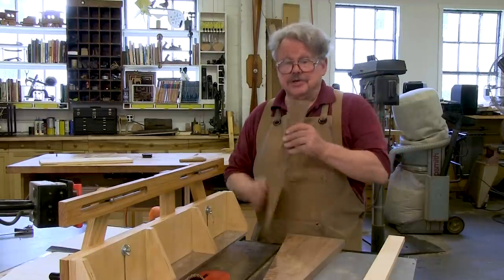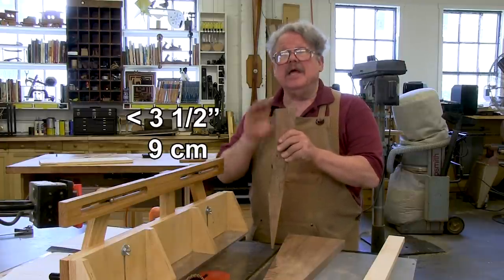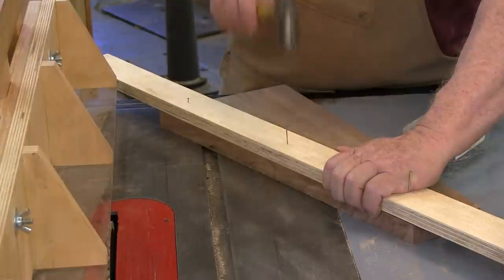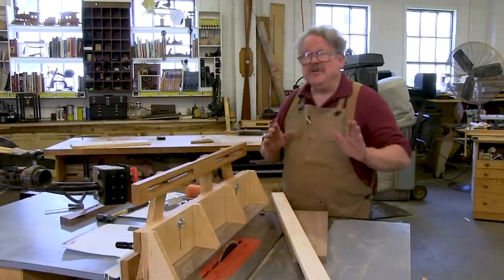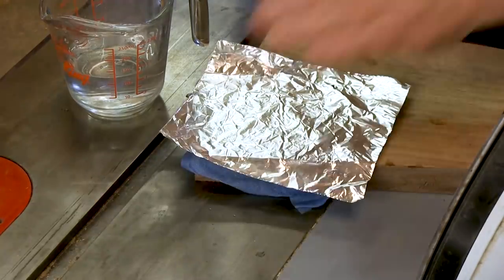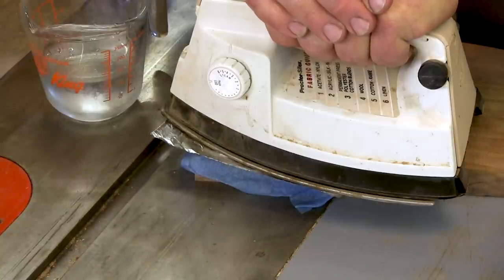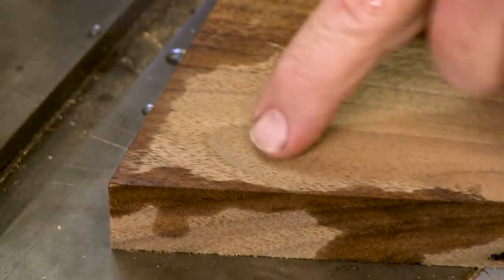Two things. First, the cut-off waste has to be less than three and a half inches wide — that's nine centimeters — in order for it to fit underneath the fence. Second, you don't have to attach the guide with carpet tape. Use brads if you don't mind the nail holes. And even if you do mind the nail holes, you don't have to live with them. Wet a paper towel and lay it over the nail hole, put a piece of aluminum foil over that, and then heat up the foil with an iron. Let up when it stops steaming. When you remove the foil and the towel, the nail hole will have almost completely disappeared. Almost.